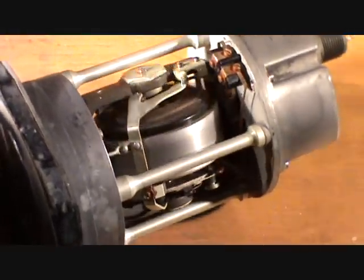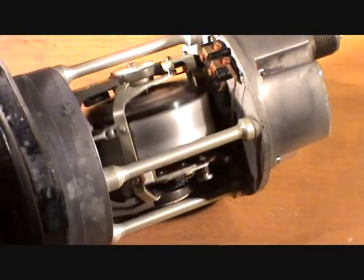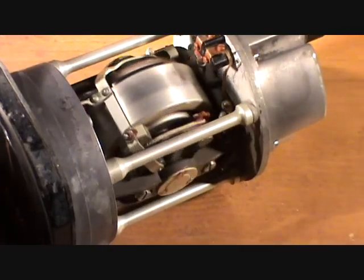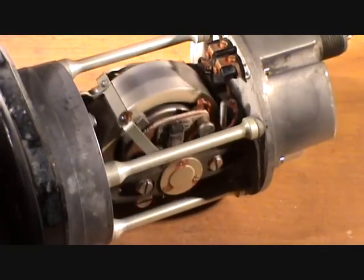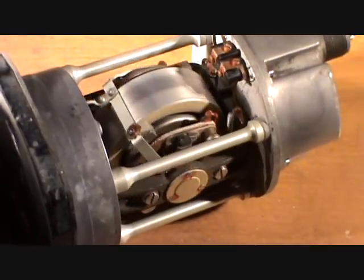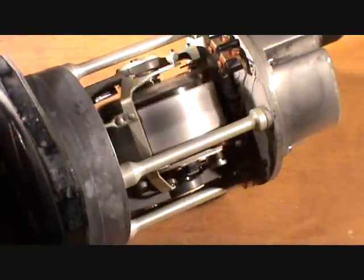In this close-up shooting, you can see the rapid reaction of the gyro gimbal when you move the indicator around the vertical axis. Rate gyros, together with accelerometers, are the main sensors of the autopilot systems, although mechanical gyros are not in use anymore, as they have been replaced by laser gyros or lately by solid-state gyros.